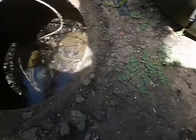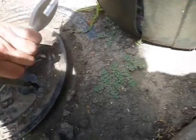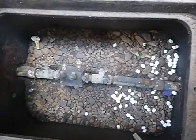Initially, this meter failed the water meter test, and I was able to isolate the problems. The most drastic one is the upstairs hall bathroom commode, which was running continuously, and then the second one was the downstairs guest bathroom commode. It was also leaking, so I isolated those valves, and so now the meter passed the meter test.